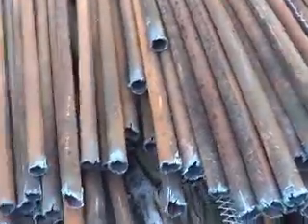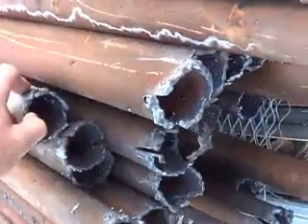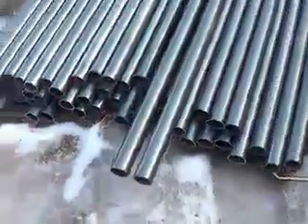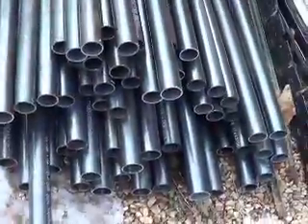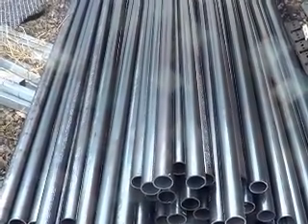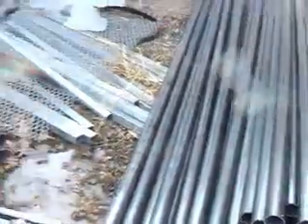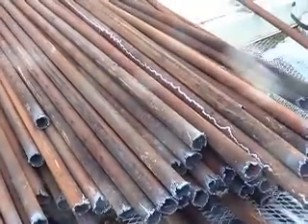Here are the old tubes they pulled out. Somebody will get a little Christmas money scrapping these out. They just cut them out with a torch and then they're going to put these new tubes in. To seal the end they've got a special tool that rolls it — they don't weld it. It's just rolled in; the friction holds it. Because these things have to move as it heats up, expands and contracts, but it stays watertight. Pretty amazing that lasts all those years.